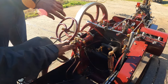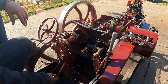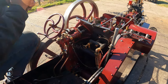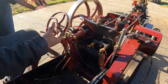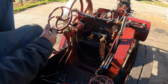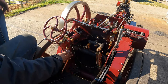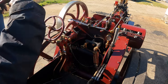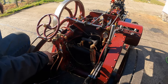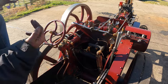A useful pump tip: if the pump isn't pumping after being left for a while, the ball valves inside can get stuck on their seats. Take the handle of a screwdriver and tap it on the top of the pump — that dislodges the balls and the pump will usually start working. If the pump has lost prime, leave all valves open, crack the boiler pressure valve slightly to remove back pressure, and run the engine very slowly. Water will eventually squirt out of the priming fitting — once it does, you've primed the pump. Nip the valve back up and the pump should work fine. 90% of pump problems are either stuck balls or lost prime — both simple fixes.